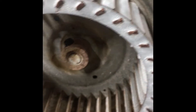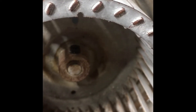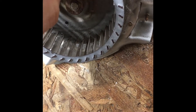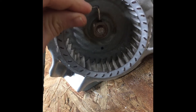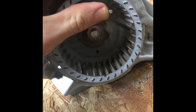I had a big pain — I couldn't get that set screw out. So I sprayed it with penetrating oil really well and let it sit for about 10 to 15 minutes, sprayed it again, let it sit for 10 more minutes. Then I took a torch and heated up where I had sprayed and it finally budged. I used a small Allen wrench that fits right down in there, and with the Allen wrench sticking out I just beat it with a hammer.